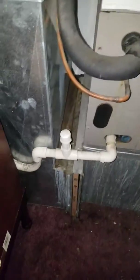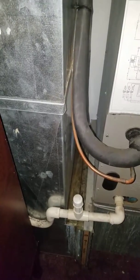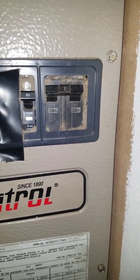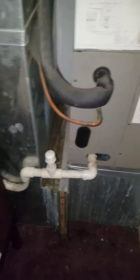We have four and a half inches right here, a three-quarter inch drain line that drains on the outside of the home, and a left-hand sided return with three-quarter and three-eighths inch refrigerant line. You have a double pole 30 and double pole 60 on the front, so you've got 10 kW heat strips in this system. The system is up on a base that's about 17 inches tall, 16 wide, about 22 down the side.